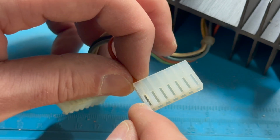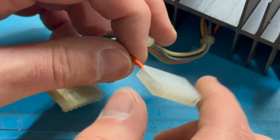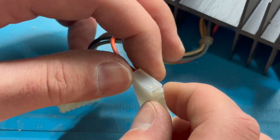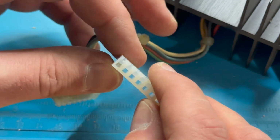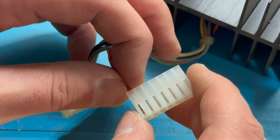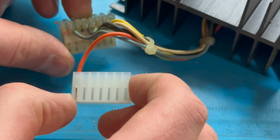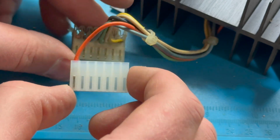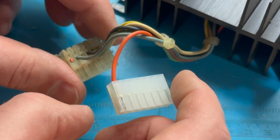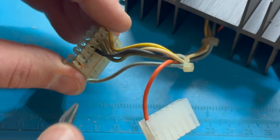And you have this little window here that you can test. You can put your probe in from your multimeter to check for continuity and make other tests without even removing the connector or the connection housing from the headers. So that's good. So we got one down and 5 more to go, because even though this is a 7-pin connection, we've only got 6 of them populated.